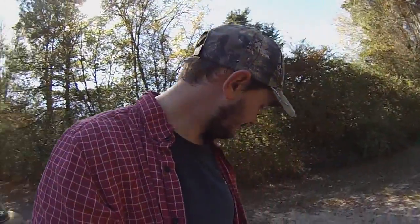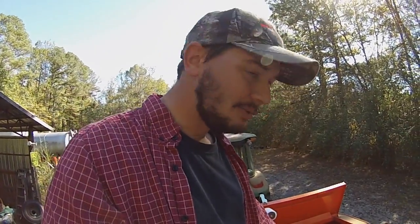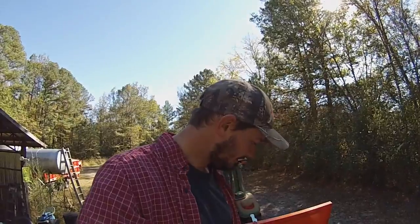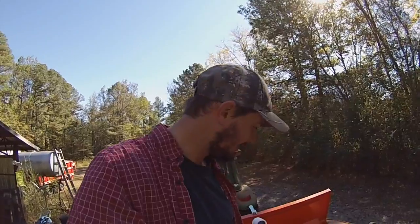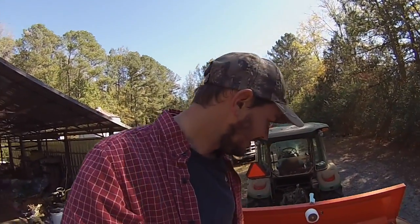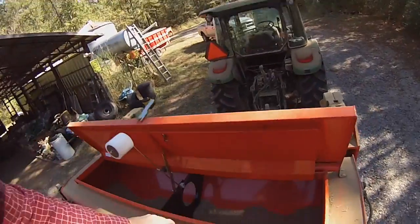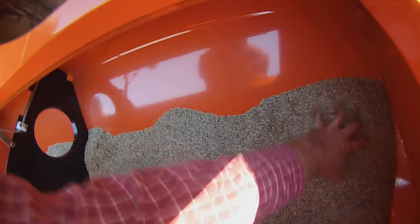Last Sunday night when I got done, I had two of my seed tubes stopped up. They were stopped up down at the bottom at the openers where those little pieces of stalk had built up. I'm about to run a wire up in there - I've got a little wire with a hook - to pull through and make sure all of those are cleaned out. That was the only drawback to getting that high rate of orchard grass mix.